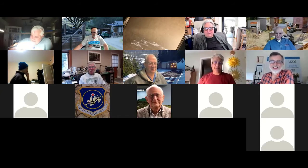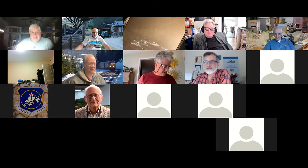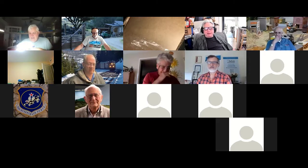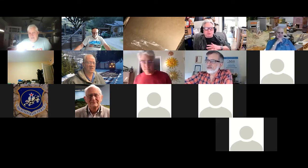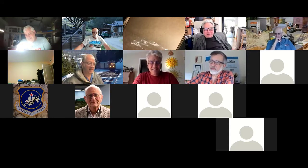Yeah, I've got a couple of Nick's hobby decoder buddies on order. Decoder buddies? Haven't you ever seen those? I've never heard of a decoder buddy. It's a substitute motherboard for 21-pin decoders, and I think you might have an 8-pin version as well. It has all of the pads laid out, including the pads for a keep alive, so that you know exactly where they are. That's just cheating. Hey, you use the tools that are available to you. There's nothing wrong with that. Yeah, for $10, it's worth every penny.